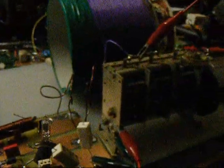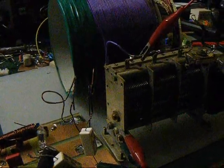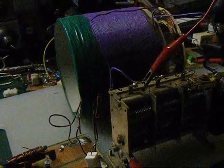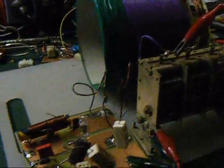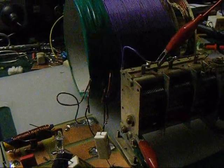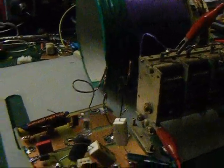That's connected to the other side of the tank, or the other side of the high voltage coil. The effect is that I'm making the ground and the plate part of the tuning capacitance for the arrangement.